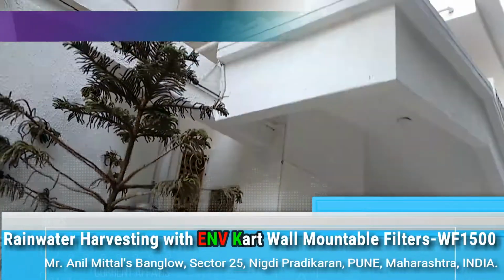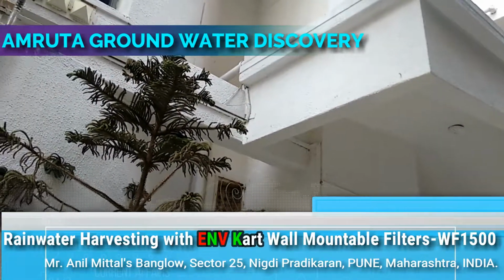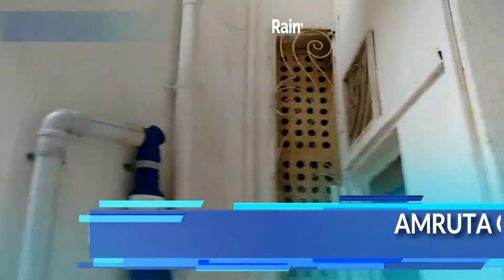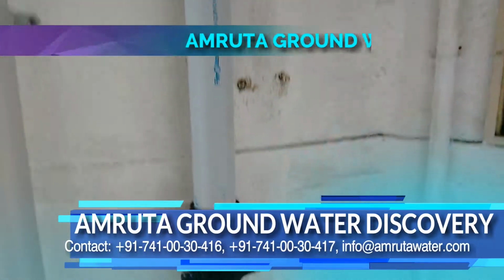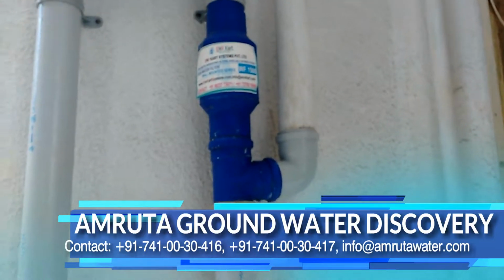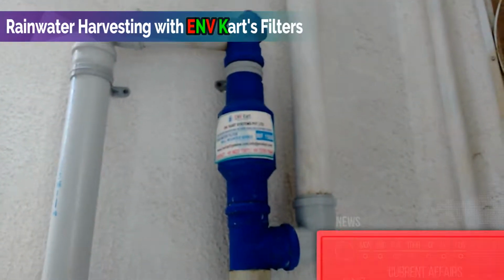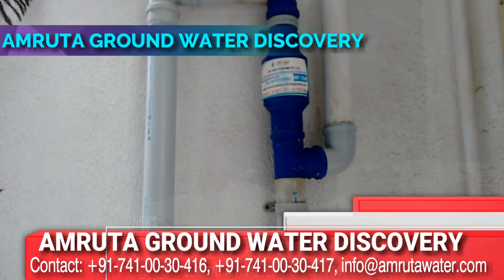You can see here, that is where the rainwater harvesting begins. This is where the rooftop downtake pipe is coming down. Earlier, this pipe was going directly to the drain. Now, what we have done is, from the ground surface, above 5 feet, we have cut the pipe and installed the rainwater harvesting filter here. This is a wall-mounted filter.